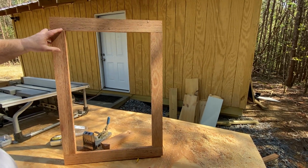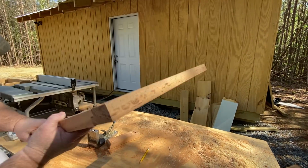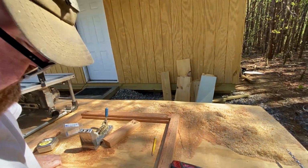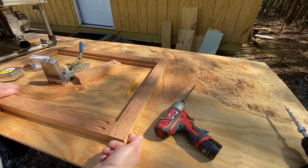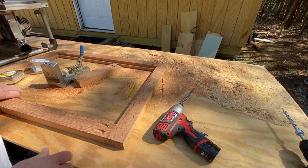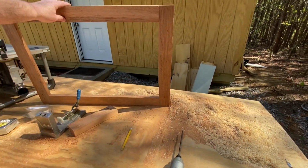Yeah, right? Miters tend to get ugly, and they're hard to pocket screw. Imagine that cut being at an angle, and now you're trying to screw. Well, these screws are too long; they'd come out. Like this one that was right here would come out the edge. So that's why cabinets are made this way, and window frames.